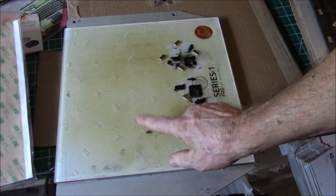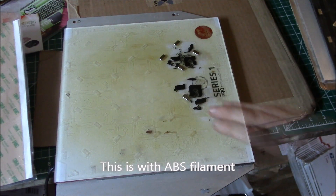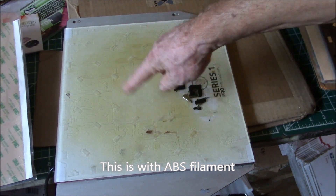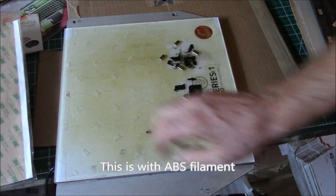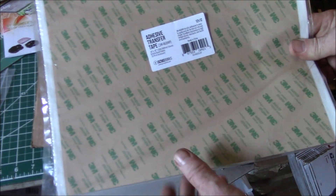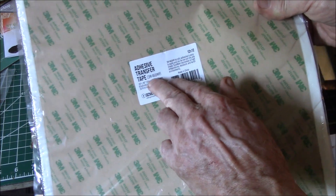What I was noticing was the front corners, where you're always lifting the flex plate off, had both released. This back corner was up too, and magnets started moving around with multiple magnets on top of each other — so this back corner was like a little ski jump. They also mentioned I can probably lower the temperature; I've been printing at 90°C but they said maybe try 80°C.